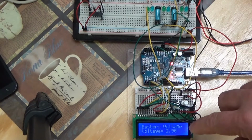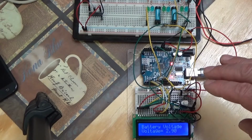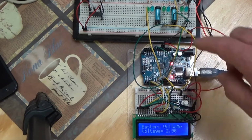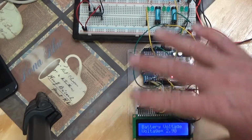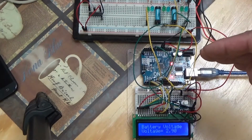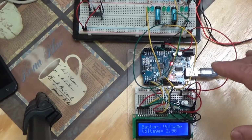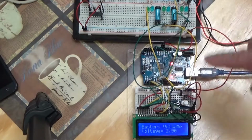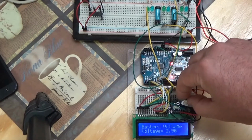Now this is going to be set at a threshold voltage that still allows us to continue charging the batteries before sunset. So the batteries will be brought back up to a certain level, but we're going to have a day-night sensor on here. After a certain time in the day, these are just going to stay off. So we're going to bring those batteries back up before nightfall, get them back in float mode, make sure everything's happy on the battery bank so it doesn't get sulfated sitting there. So there is going to be a timer on here, day-night charger, but for now that's not done yet. I do have that one at home, which I'm going to show you later.